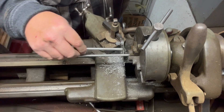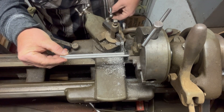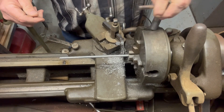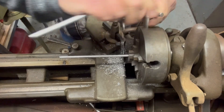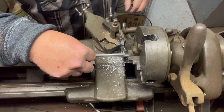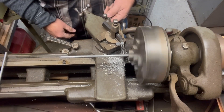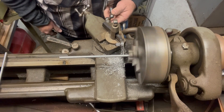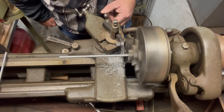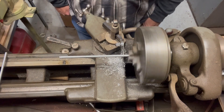Guy just eyeballs a whole bunch of this. Tighten number four, tighten number one, go back and check number four, tighten up — this is just aluminum. Double check our length — yeah, it looks good. Cut the second groove real quick. That depth looks pretty good; give it a second to just kind of true up a little bit.